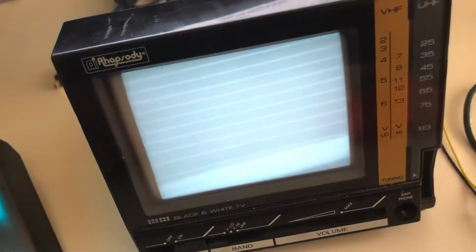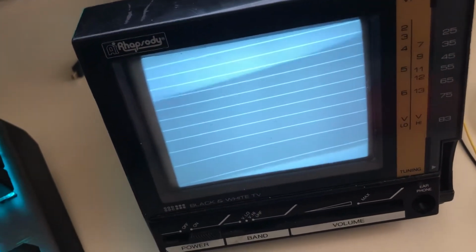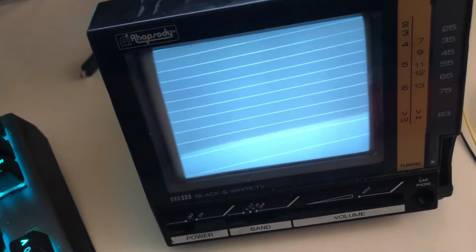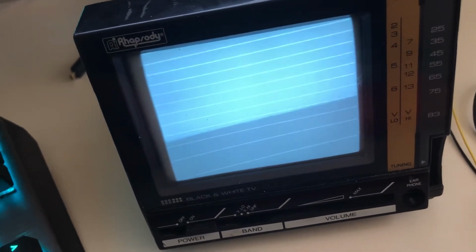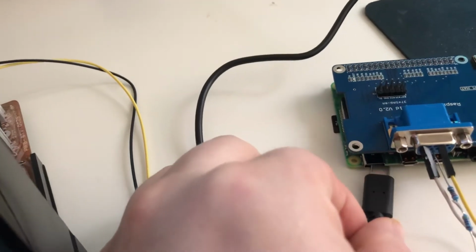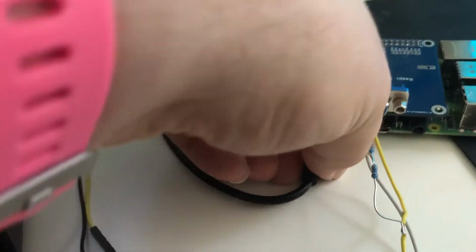Wait for it to warm up a little. You can see the flyback lines as well, which there's not much I can do about at the moment until I throw some pull-downs on the actual video signal. The all-in-one chip isn't helping matters much here, but on the upside, at least we have proof that the video raster is being built correctly. So once we power it up, that will go away once there's actually an image being drawn on the screen and the guns aren't trying to overdrive it.